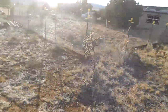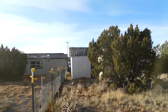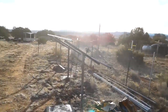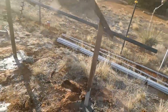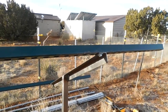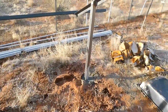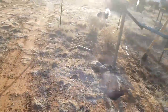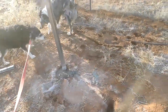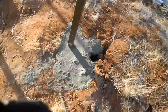This is a ground mount. That is what we did in the last video. I still need to get up here and tie those wires down. I already got the frame built. This is all Unirail and 2-inch square tubing. It's down 34 inches. That's 2-inch, 1/8 inch angle. About a bag and a half of cement is what it took in each one. I just topped off all of these because there's about 6 inches off, so I made some overly wet cement and dumped it in here.